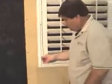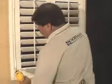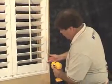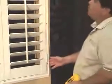Now that the panels are installed, we can continue securing the frame. We'll start by placing a screw in the pre-drilled hole in the lower left hand corner. We'll rack the panels side to side. Once they're lined up on the top and on the bottom, we can go ahead and secure the screw, making sure that the panels stay lined up. Now that the left hand bottom is complete, we'll insert a screw in the right hand pre-drilled hole at the bottom and secure this frame to the wall. We'll continue to check our evenness across the top and the bottom.